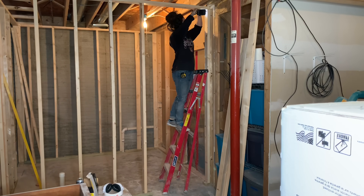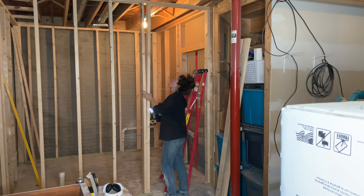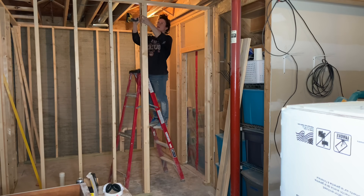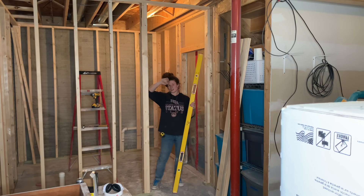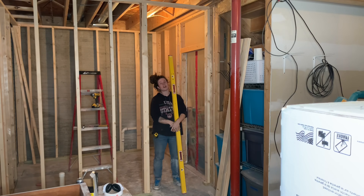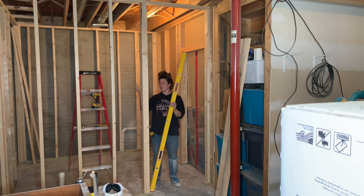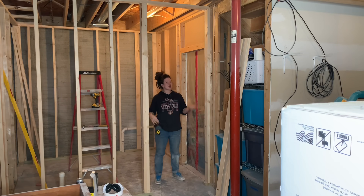In my layout, both of my king studs had either a wall or a layout stud directly behind them, so I'm doing a lot of lateral fastening, but all you need is two screws or nails attaching your stud to the top plate and to the bottom plate. I had already checked that this existing wall was completely plumb, so I was able to screw this king stud directly into the wall. As far as this one, I already had a stud on my 16-inch on-center layout that was completely plumb, so I was able to hold this king stud directly to that next stud. If you have a normal setup, just get either your top or bottom in place, take a level, put it against the stud, adjust until it's plumb, and then finish attaching the king studs. It does not have to be perfect, but the better your framing is, the easier it will be to install your door in the trim stage.